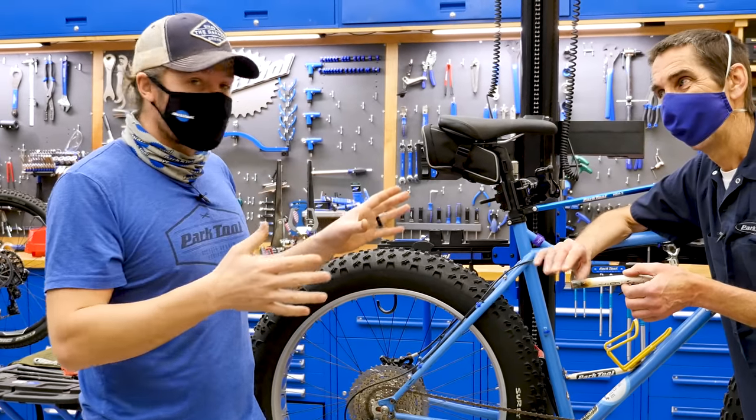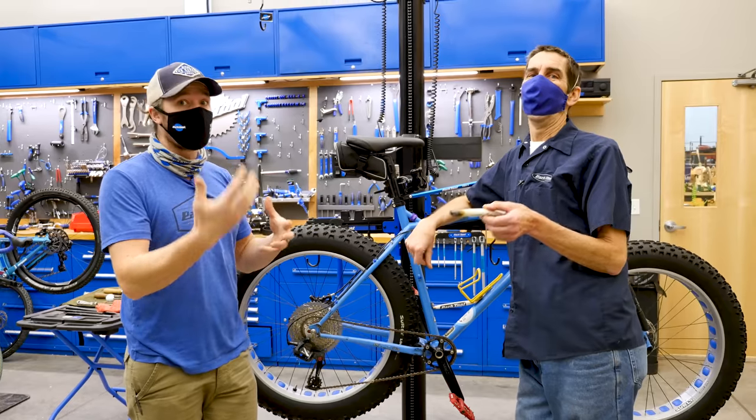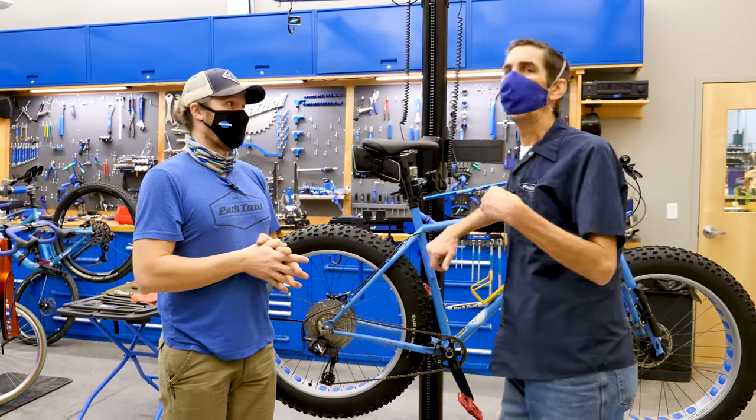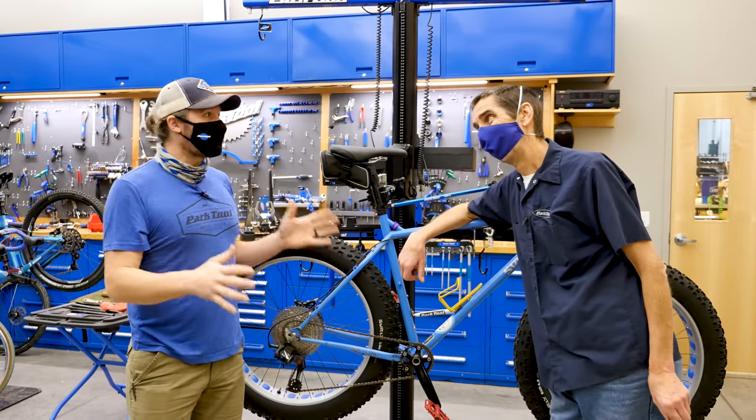We're going to make this permanent with a hot glue gun that is actually brazing. It's a delicate process. You don't want to get things too hot. You can't have things too cool, otherwise it won't flow. Quick disclaimer, not a frame builder. Not a frame builder either. This is a complete experiment.